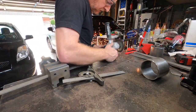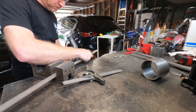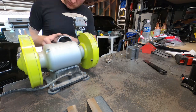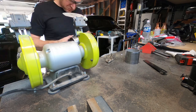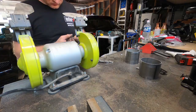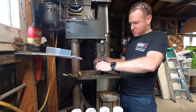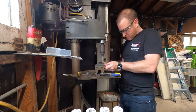Next up, I use one of the flat stock pieces and cut it down into tabs to tie the jack together. I pull out the bench grinder, which is magnetically held to the bench so it's not as dangerous as it looks, and I use it to both deburr the cutoffs from the pipe and round off the corners of the tabs that will tie the entire jack together. Then it's over to the drill press where I drill some quarter-inch holes for the hardware to hold everything together.